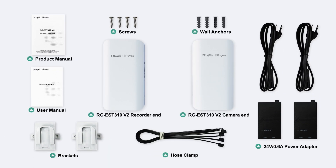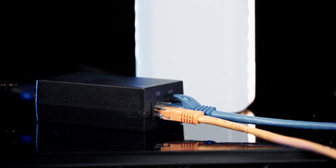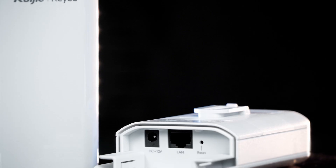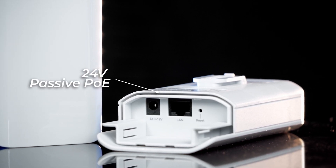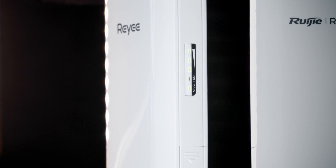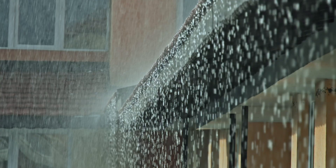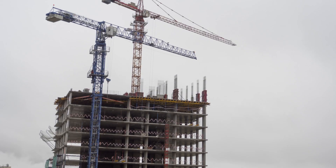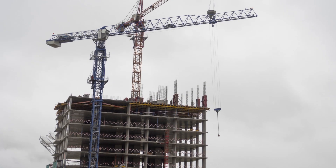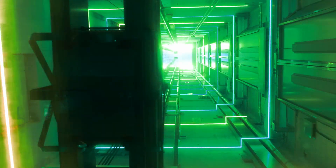You'll find a single 100 megabits per second LAN port on each device's injector, powered via 24 volt passive PoE which keeps cabling simple. A set of LEDs on the side show your signal strength, making alignment straightforward. These bridges are IP54 weather rated and can operate in temperatures ranging from minus 30 to positive 55 degrees Celsius — whether they're outside in the cold or in a warm elevator shaft, they're built to last.